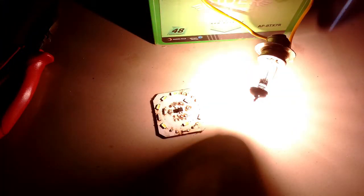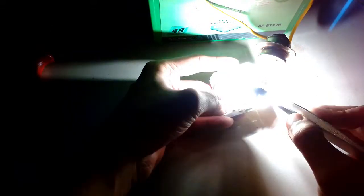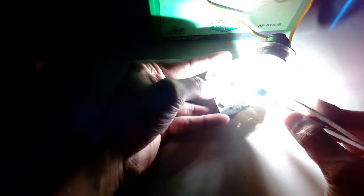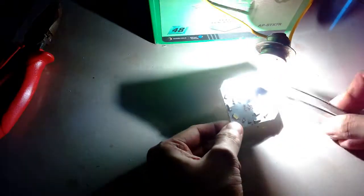This one is 55-60 watt, so higher wattage is better. I'm using the filament with the shield that is used for the low beam, which redirects and focuses all the radiation in one spot. You can see I have placed the circuit board right below the shield, and as it heats up I use a tweezer to take the component and place it aside.